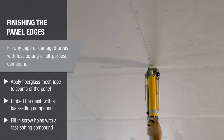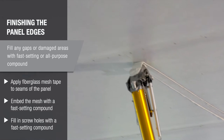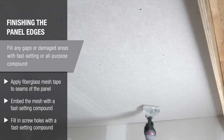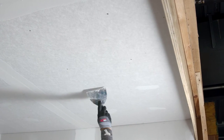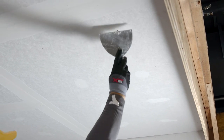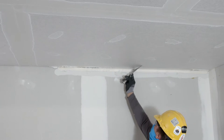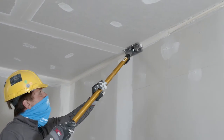Alternatively, tape the joints using an automatic taping tool with ready-mix joint compound and fiberglass tape. Do not use paper tape with automatic taping tools. Spot the screw holes in the field with fast-setting compound — do not stripe the screws. Cover as little of the face with joint compound as possible to maximize the acoustical performance of the ceiling. At the walls, use paper tape with ready-mixed all-purpose compound, applied with a taping knife or corner roller.